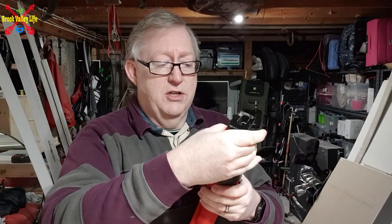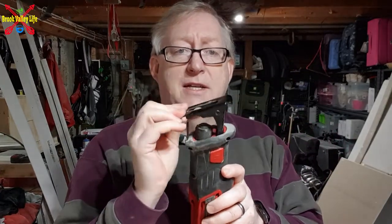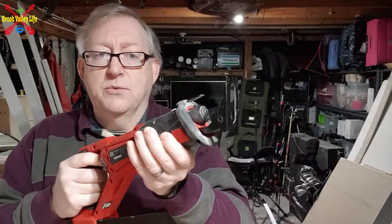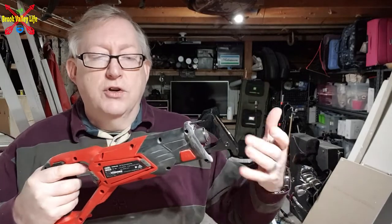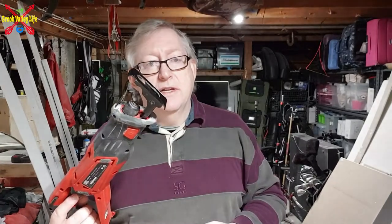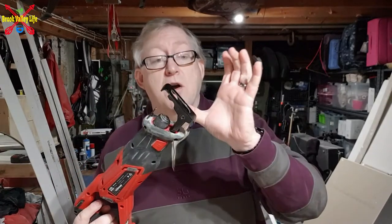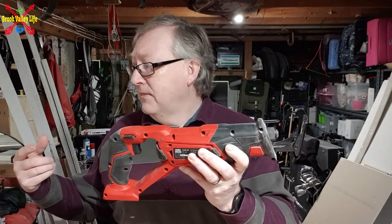You've got a lock at the front — when you put your blade in it will lock into position and won't come out. The bit at the front is designed to move and contour whatever you're cutting, so you push it against the material and cut away. You can keep it hard against it as it goes down, because if you're away from it, it could rattle. These things are great for cutting through wood, metal, you name it — a bit better than a jigsaw on some things. If you don't have a chainsaw, it will cut through wooden branches. It will also cut drywall — pretty much anything you need.